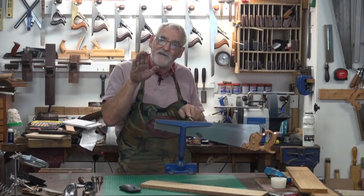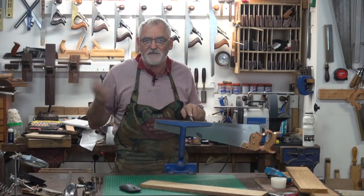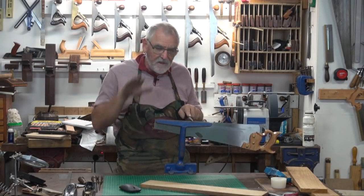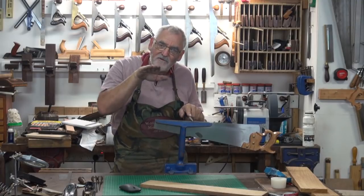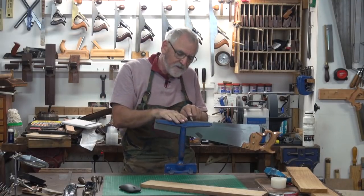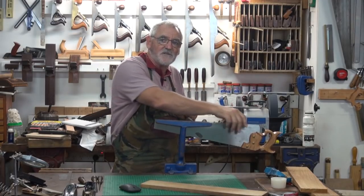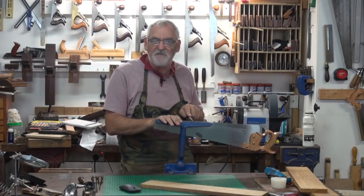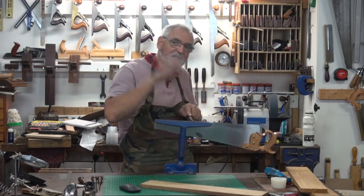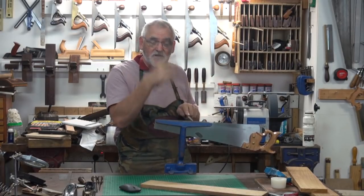But sometimes if you've got a saw that's been hacked about or somebody's messed around with it and messed all the teeth up, you can then counteract. If you've got a flat spot, you take a little bit off the front, a little bit off the back, and set the saw. This doesn't need setting. This is the first time it's been sharpened. Generally, you'll get about 5 or 6 sharpens before you have to reset it. But I'll show you how to set in another video. Actually, no, when we're doing that distance saw, I'll show you how to set.